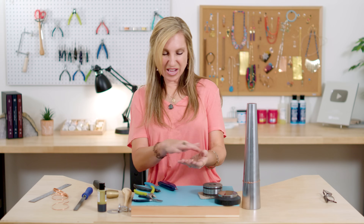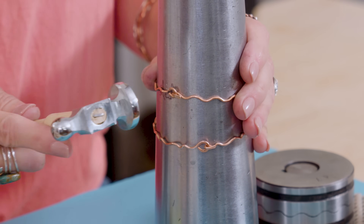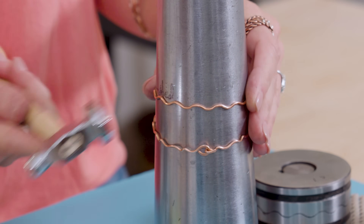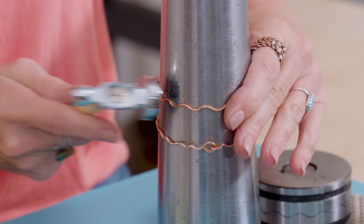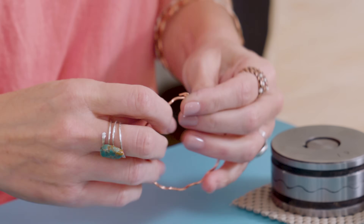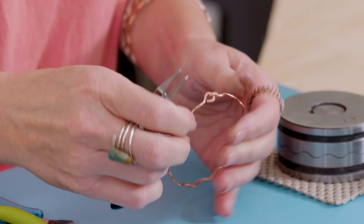The final step for me, because it's not perfectly round, is just to pop it down onto your bracelet mandrel and then just give it a hammer right there. And always hammer right up on the place where I put it together because it kind of finishes it off. And then just go around the bangle with your chasing hammer - this flat domed side - and flatten it out. You can texturize it if you want to. I'm really just hardening it up and flattening it out a little bit. Then I'll go right back over on my finish just to finish it off. Pull that back off, check everything out just in case it got a little crazy. So I'm just going to bring it in and squeeze him down one more time. So it's finished. And that's perfect. I love it.